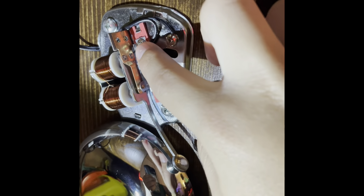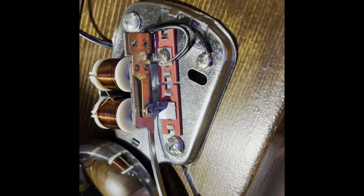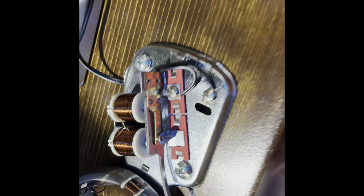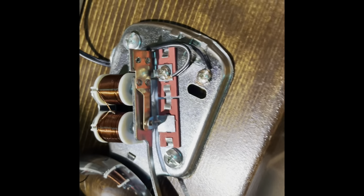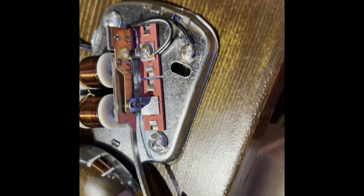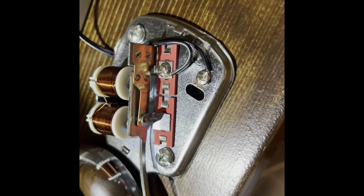My bell has no polarity, so you can wire positive here and negative there, or swap them — it doesn't matter. But your bell might have polarity, meaning it has designated terminals, so you'd put positive in one spot and negative in the other. Get your power source, whether a battery or transformer, make sure your voltage is correct, and read the instructions. If there's no polarity, wire to either terminal. If there is polarity, positive to positive, negative to negative, red to red, black to black. If it's a pigtail connection, wire nuts are always better than quick connectors.